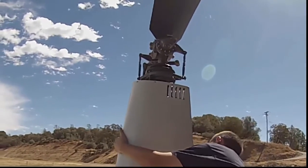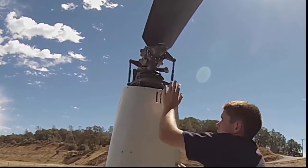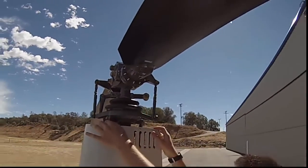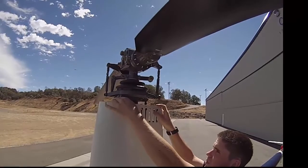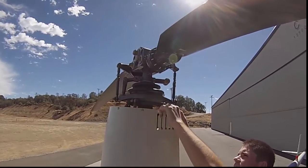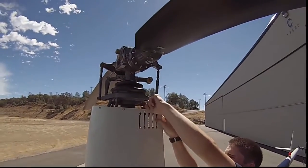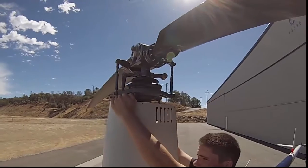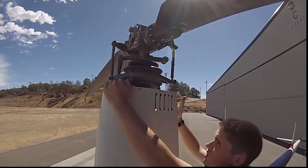Visually and physically check for no dents on the other side as well. Then move up to the main rotor hub. We have these control rods — they transmit our inputs from the controls up to the main rotor hub. Make sure these are secure and check all the bolts and nuts. You have one control rod here and one over here. Move them up and down — they should move back and forth but have no play up or down. Check the third control rod on the other side as well.